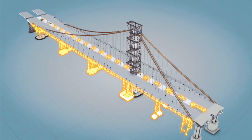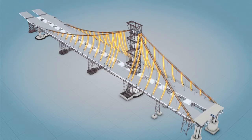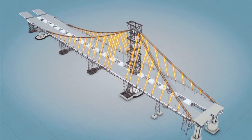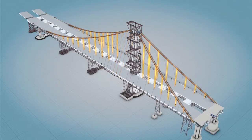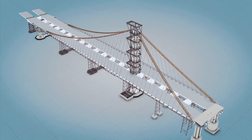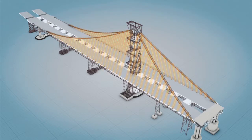There is the support system — the temporary works. This had to be done in three different phases. The first phase was to connect 104 cables that would be pulling on the main cable; it deforms a little bit into its final geometry. Second phase: the suspenders near the tower. Third phase: distributing the weight on the remaining 96 strands. And then this is the system that is holding up the bridge after load transfer.